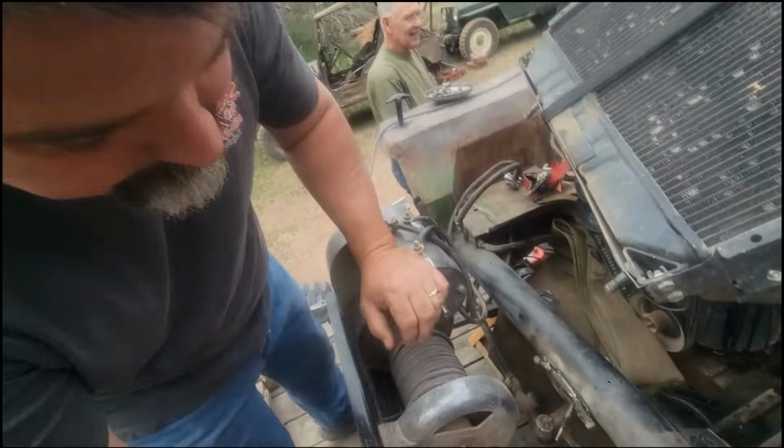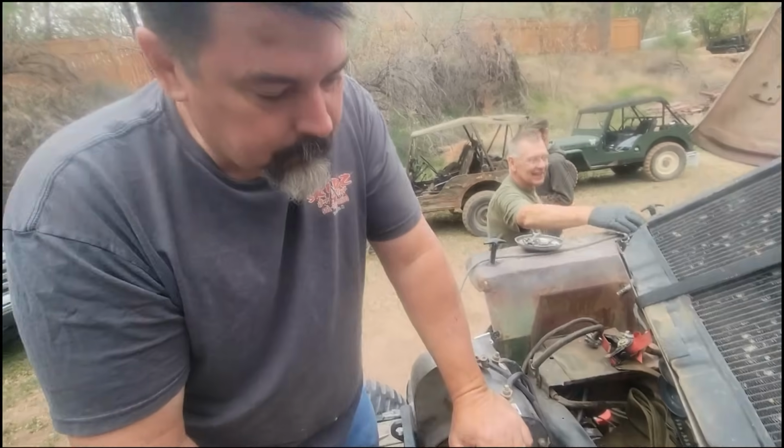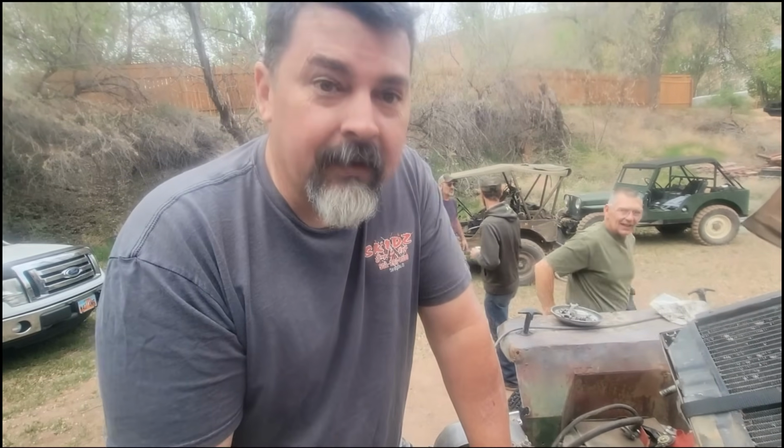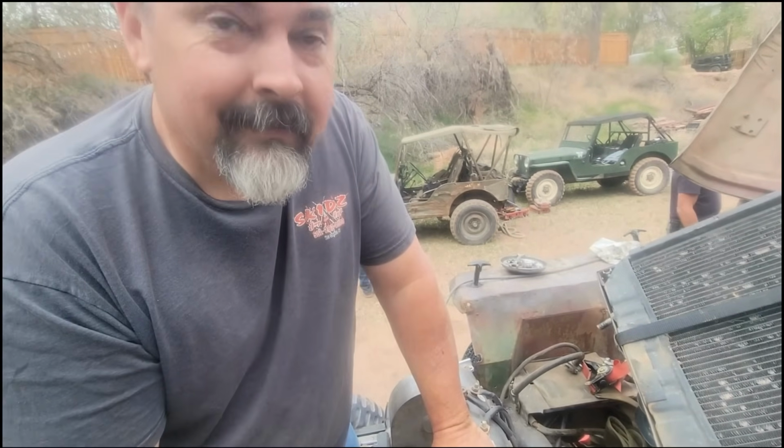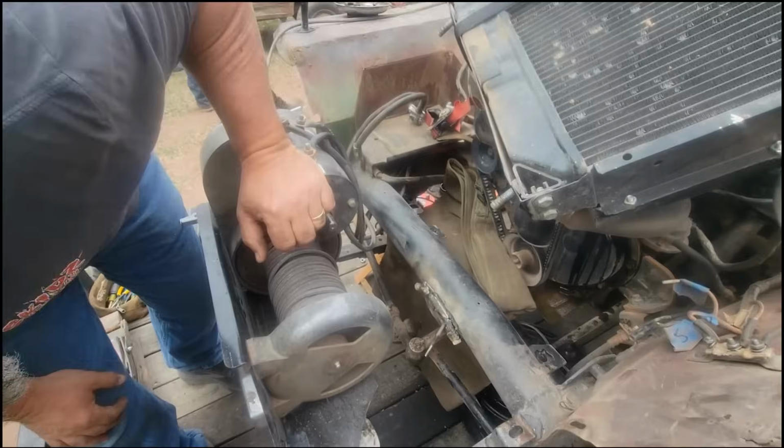Welcome. How are you going to weld it? Give us a little more detail. We're going to do a 6011 at 100 amps, and that's about it. All right. Well, we'll look forward to the finished product. Thank you so much.